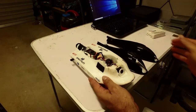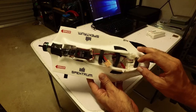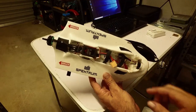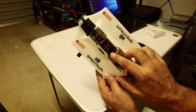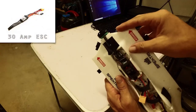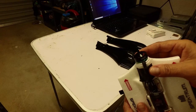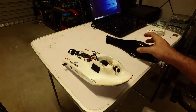Inside it I've got my RunCam Robin — it's already installed, the wiring's all set up, it just needs the video transmitter put in. We've got a 1300 milliamp four-cell battery which will fit in here. It's running a Spektrum AS3X receiver with a built-in stabilizer. The ESC — not too sure about the specs, it doesn't really say. The motor is a 2350 kV thrust motor.